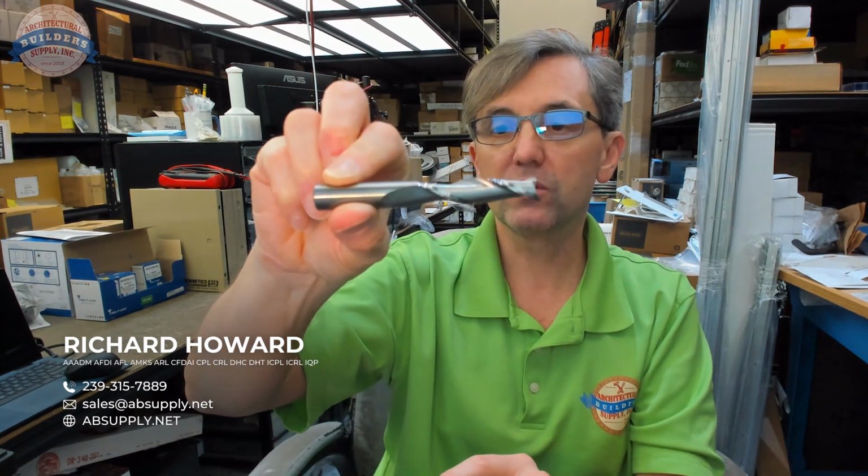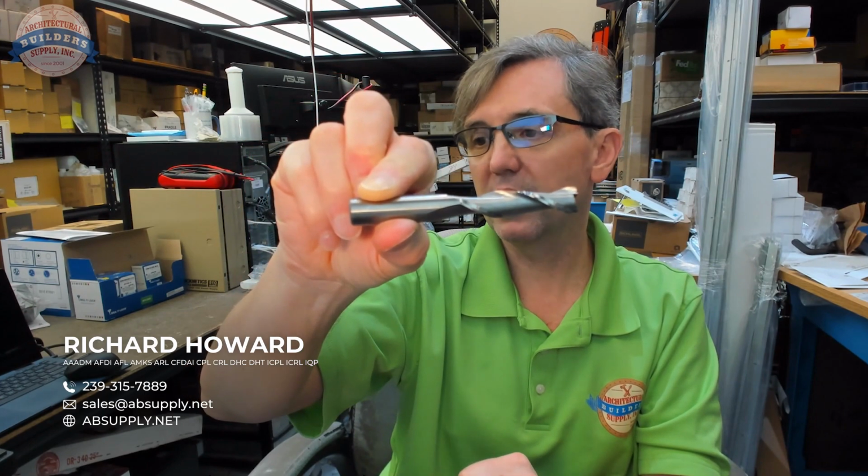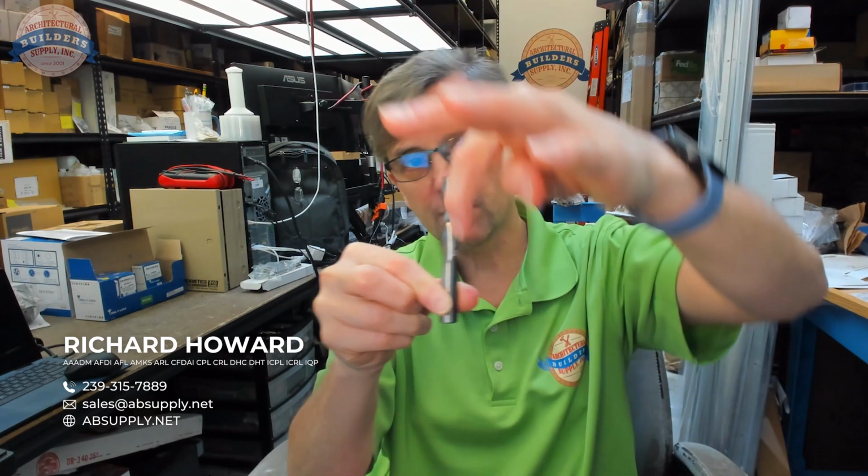It is a spiral, as you can see. It's half-inch. It's going to go into your router with a half-inch collet in it, but it is what's called an up shear. So basically the rotation of the spiral on this is opposite of what you would generally see in router bits. There's up spiral and down spiral, and the entire difference here has everything to do with chip evacuation. Basically, when you're doing a deep mortise, as you're going to do when you are doing a mortise pocket in a door, or when you're doing any sort of hardware, like you're going to prep a solid core structural lumber or a stave lumber core door for exit device hardware, or you're making a mortise pocket, or you're doing overhead stops, you're doing anything deeper than just a hinge, let's say.